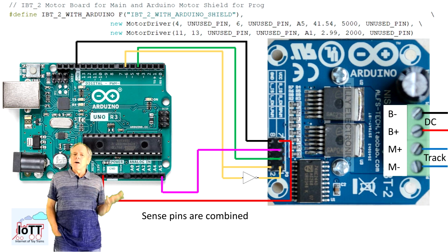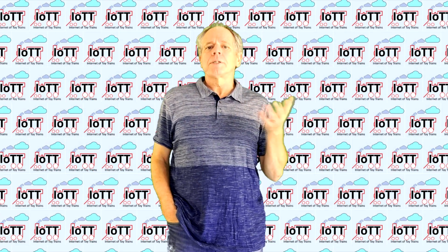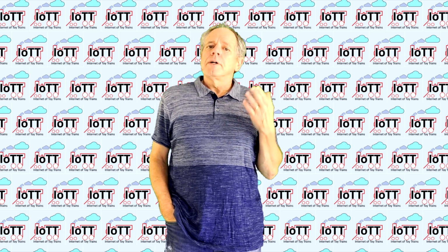The power connections on the other end of the board are straightforward. Connect a power supply to the inputs and the track to the motor output. On the standard IBT-2, the inputs are labeled B+ and B- and the outputs are M+ and M-. On my other board, the inputs are labeled VS and ground, and out 1 and out 2 is used for the track output. In any case, make sure not to reverse the polarity because the modules are not protected against that.